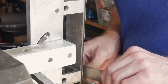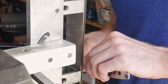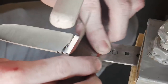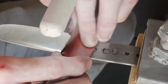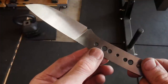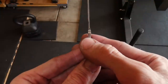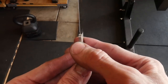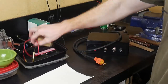After that I moved on to a 220-grit belt. What you just saw me do — and it could be superstitious — is grind one side of the blade, get that plunge line dialed in, then take the belt off, flip it around so the same side of the belt is grinding the other plunge line. I've heard people say it makes a difference, so I gave it a shot. My results were fairly good. I did gum up the finish once or twice, so I went back with hand sanding to get the flats to a nice 320-grit finish.